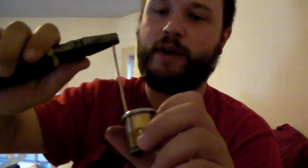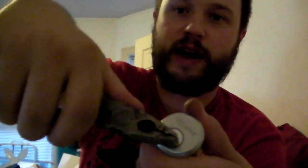This one's of a good width, too. I just cut off a length — say that much — with my cutters. Then take a pair of pliers, hold the end of it there, and then I actually just drop it into the keyway of a lock core. There you go. And then I twist the core, and that gives us a really nice bend in the end of one side.